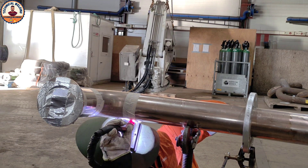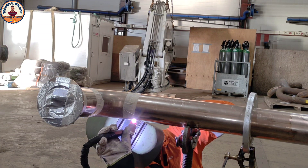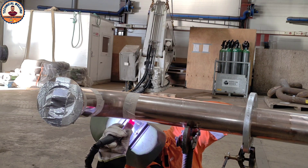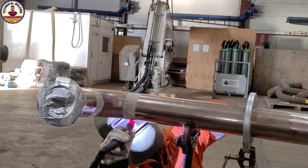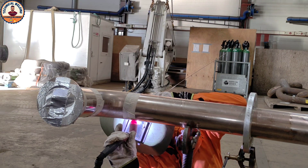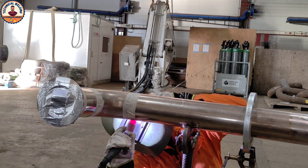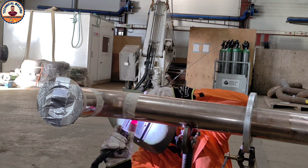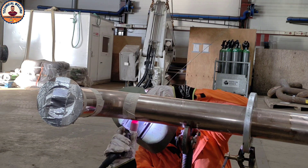This procedure is very similar to stainless steel. If you have done stainless steel welding before, you can also weld copper-nickel — it is not difficult. There are two or three tricks: don't hold the torch in one place for more than five to ten seconds or you'll get burn-through. Just move normally while heating and feed the filler slowly, and it will go into the root.